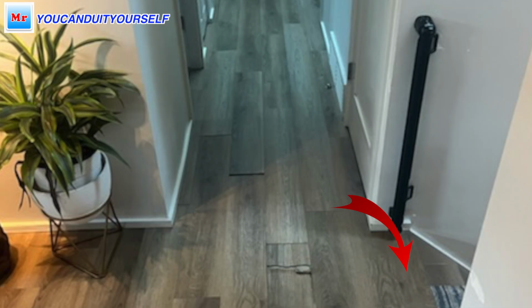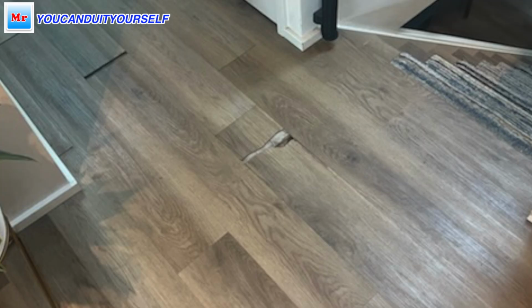Another thing, there is a nosing. It's glued to the subfloor, to make it flush with the floating floor, and the nosing is solid. The floor is floating. When people are walking in the hallway, the hallway is always moving, and if there is some low spot or high spot, the floor vibrates, and that's why pieces break the locks and start separating, going to both sides and making some cracks.